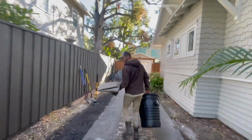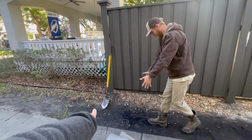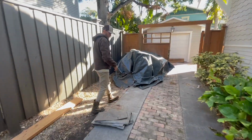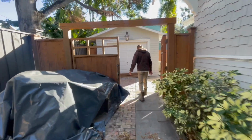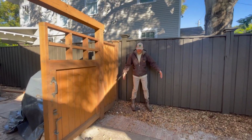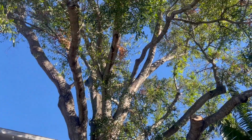Absolutely. We're starting back there at that first part. Coming down here along this concrete pad, we got some brick pavers that we're just going to lift out of the way. Put a drain system underneath those guys. Run that all the way along here. We're going to have a basin right there on that concrete that comes across and connects in. Same thing over here. Going to just come straight across into a sump basin, which we're going to put roughly in this area. From there, it's just straight PVC out to the end.